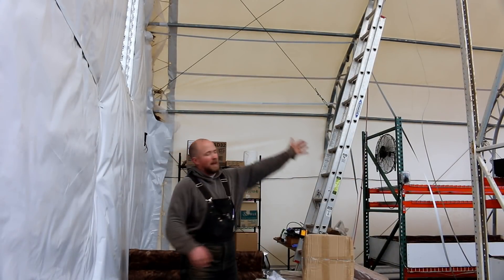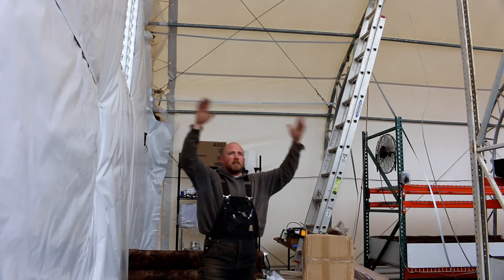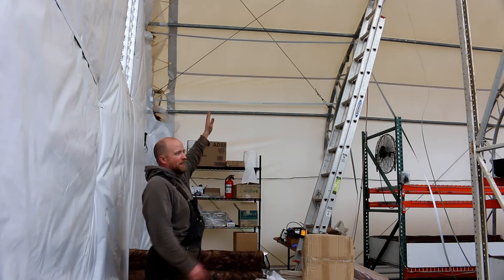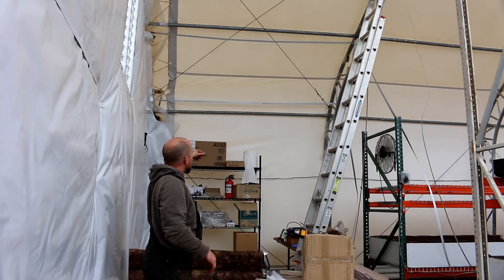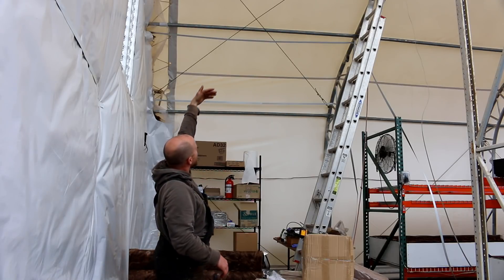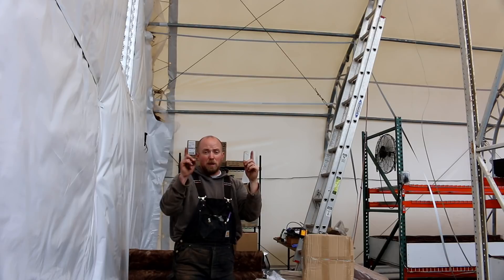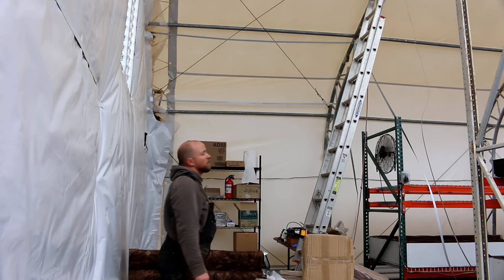The instructions say to run these bands perpendicular to the direction I'm bringing the insulation up. The insulation goes up this way — it's a 10-foot section, insulation is five feet wide, so two rows per section. I put three bands up and there'll be six on this section total. But I realized both ends have cables making an X going all the way up, and based on where those cables are there's no way to feed insulation up through there. I also can't get the ladder in a good position to feed from the bottom up. So I'm going to try something different — leave these bands just in case, but I think I'll end up using short sections of metal band, about a foot long with two screws, tacked to the metal cross members running perpendicular to the insulation direction.